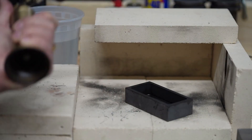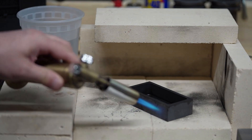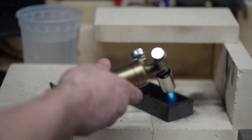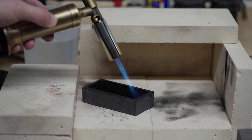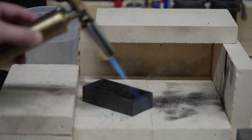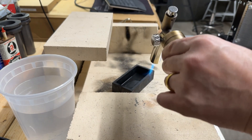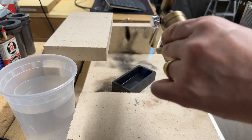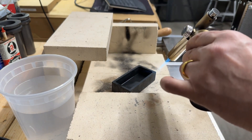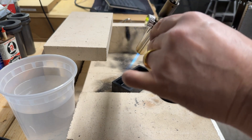Just before the peak melting point of your metal, you'll want to season your ingot mold. Use a regular hand torch to bring the mold up to temperature — you never want to pour into something cold. First, it prevents little pockets from forming in your pour. Second, and more importantly, it could save your life, because molten hot metal hitting a cold surface can cause a chemical reaction that splashes metal all over the place. Safety first — always do your due diligence before doing anything like this.